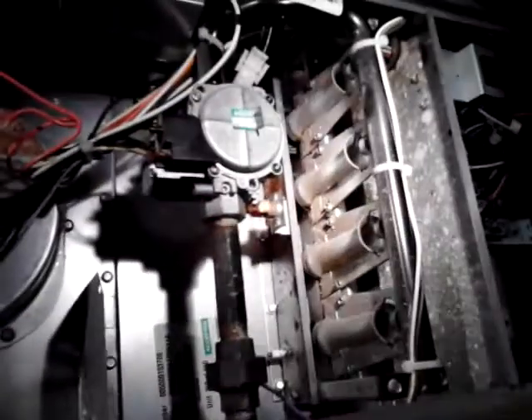If at any point in that cycle something breaks down, it's pretty easy to troubleshoot if you have a basic understanding of electricity and you know the sequence in which things happen. The thermostat goes to the board — assuming the thermostat is working properly — turns on your induced draft blower motor, to your pressure switches, and other series of safety switches such as the rollouts or the over-limit switches, which then tells the board to turn on your igniter, located back in there — you can see it. Then your gas valve will kick on, followed by your blower, until the call for heat is satisfied.